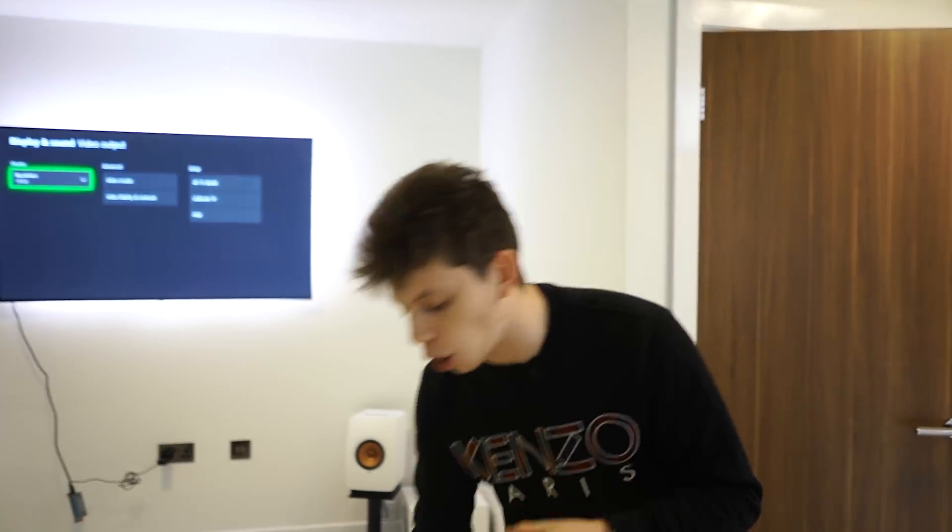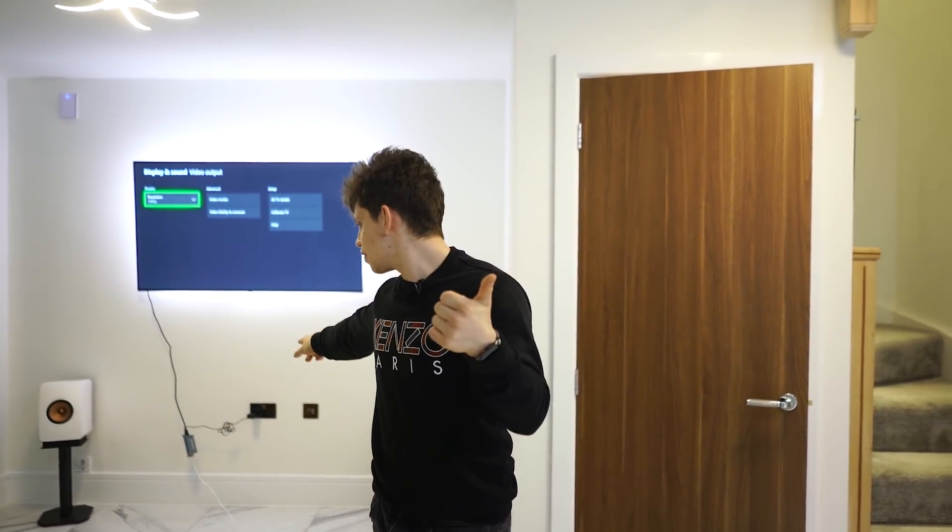The reason we tried it in 720p was we thought it wasn't working through the powerlines because of the amount of data required for a 1080p signal. Still didn't work at 720p. I tried it with the powerlines going straight from sender to receiver, and through the house's network. As soon as you introduce the powerlines to the setup, it just doesn't work. It's really odd because I've seen loads of videos online of people getting this to work, and I bought the exact same hardware as one of those videos and tried to replicate exactly what he did — absolutely nothing.